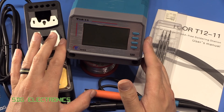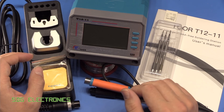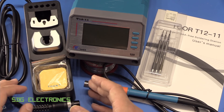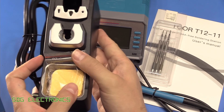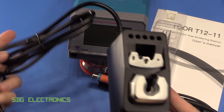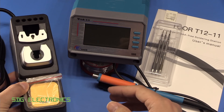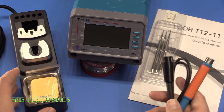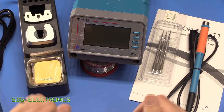This unit is rated for about 75 watts into the soldering tip, so very similar to the standard power output of these types of devices. One nice thing about this unit is the handpiece actually connects into the soldering iron holder, so you can have the unit remotely mounted away from the stand, and you've still got your standard lead length coming from the stand so that you can solder in freedom. This is quite nice because this doesn't have to be directly on the workbench.